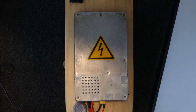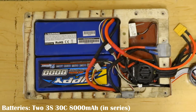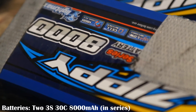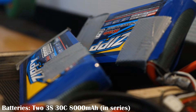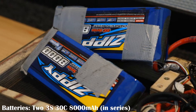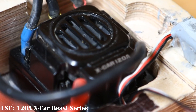The three basic components you need for an electric skateboard are the batteries, a speed controller, and a motor. There are different battery capacities, cell counts, and battery types you can choose from, but I decided to go for two 3S 8000mAh LiPo packs. My speed controller is rated at 6S maximum, so the plan was to wire these two packs in series. This doubles the cell count but keeps the capacity at the same level, meaning my battery pack is a 6S 8000mAh pack.